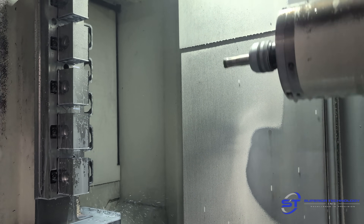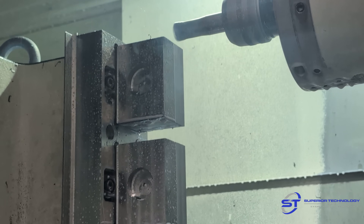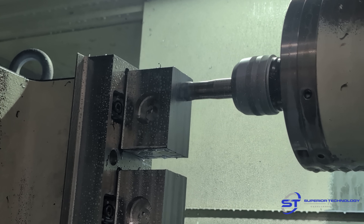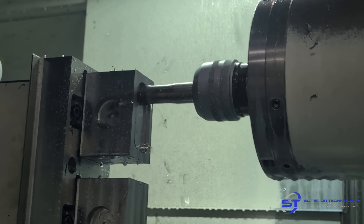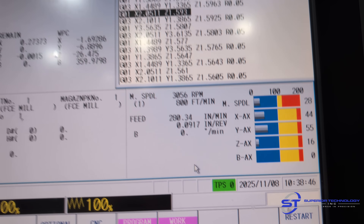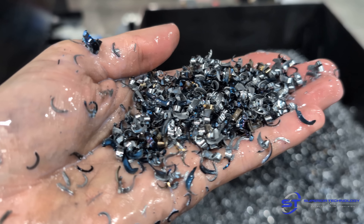Finishing up the other side, now going to the faces. Same feed mill running the same speeds and feeds, just roughing the tops off. Now it's going to start doing the majority of the material removal, roughing out the entire center of the part. Running the same speeds and feeds but a 32-thou step down instead of 30. Just a quick look at the chips — they're not huge but there's a lot of them; they come off very fast given the amount of material.